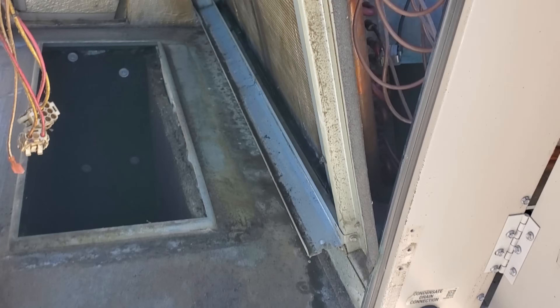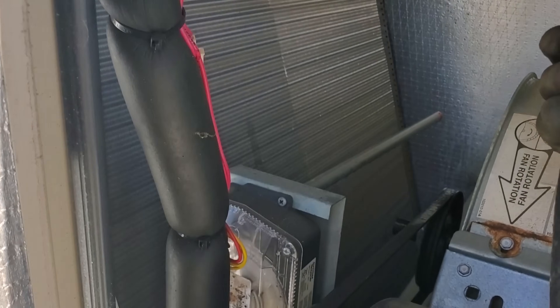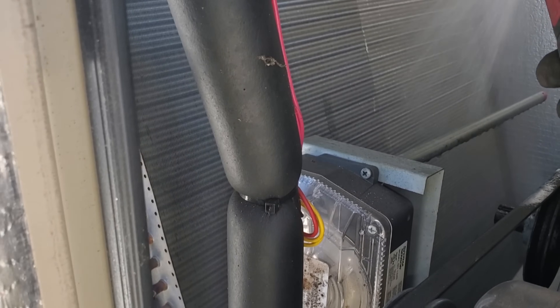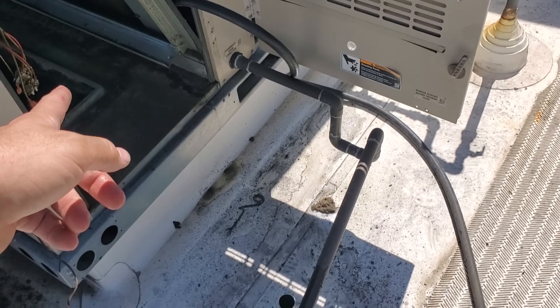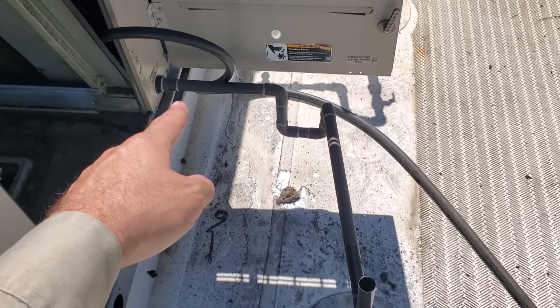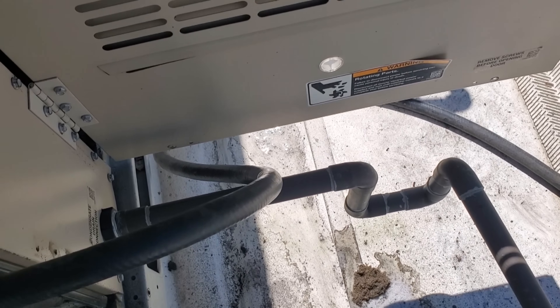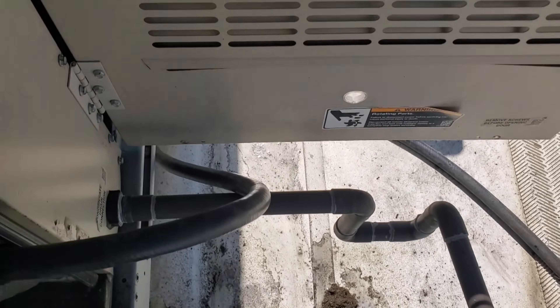Obviously we're going to rinse from the other side too — got to be careful because we could be blowing it out the evaporator on the other side. We want to make sure we're not overflowing anything — nice and slow. We're not coming out the other side, but it's running down the drain, that's good. We're going to give the drain pan a rinse too and make sure we blow that out. Some of these Lennox units are kind of nice and you can actually get your hand in the drain pan to back-blow the drain line out. I could put a union there, but it's even better when I can get my hand back down in here, hit the drain line and boom — blow it out this way. That way we know we're nice and clear.